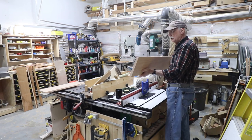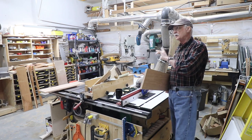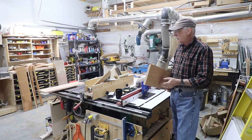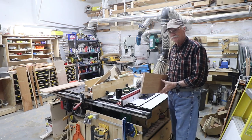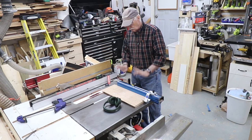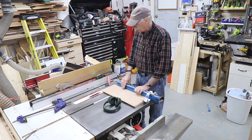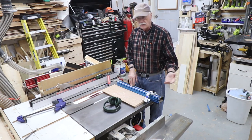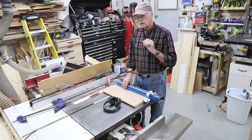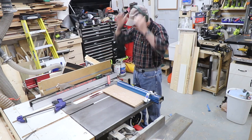Profile is in place. What I'm going to do now is take the shorter ones, cut them to the correct length, put the miter on, and that's basically what they'll be done until we do the profile for the bracket feet themselves. The chop saw is too tall for the current configuration, so I'm using the miter gauge with a stop block and 45-degree bevel on the saw blade. I've checked it — it's perfect. I'll run this through and show you the cut, do the other short one the same way. The long one is going to be a bit of a challenge. The important cut is the first cut; the second cut is the sneak-up cut on the long one since I'm doing it on the front of the unit.